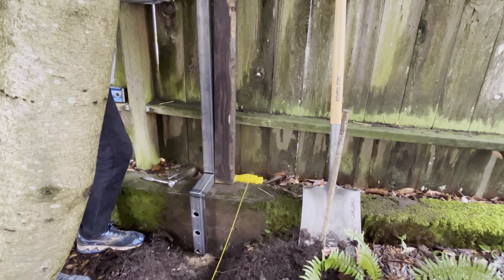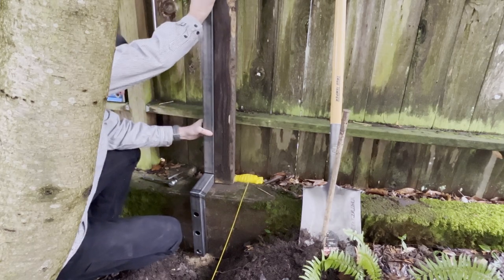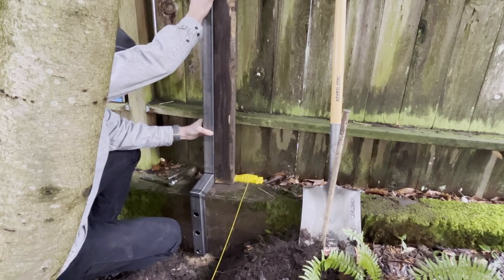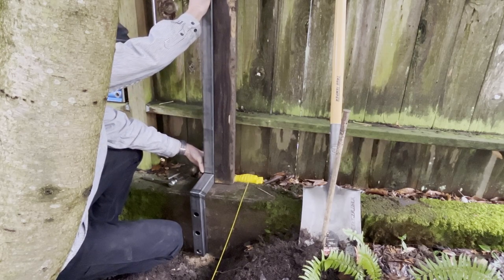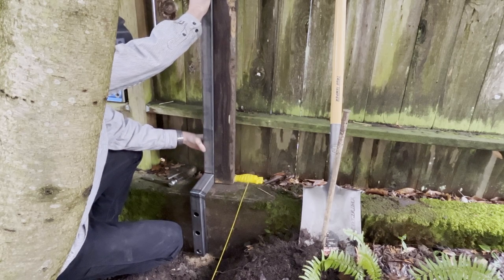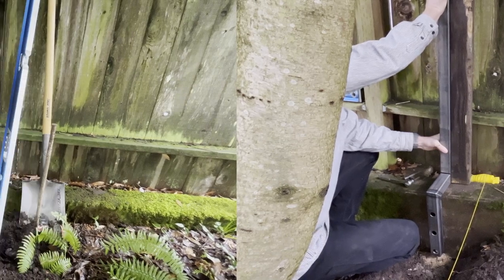It'd be nice to weld it out here, but I think I'm gonna just bring it back in the shop and weld it. And I just need to gauge how far off of a clean joint it is. And it looks like if I can just reproduce that gap, I'll just tack it, bring it back out and place it and make sure that it's lining up well, and then bring it back in and weld it.